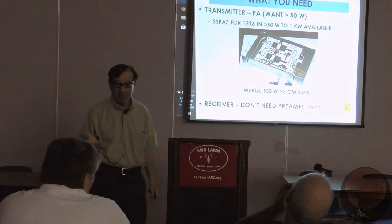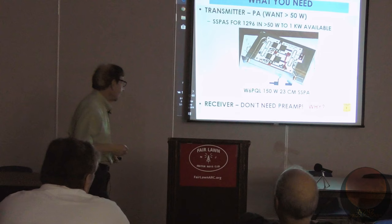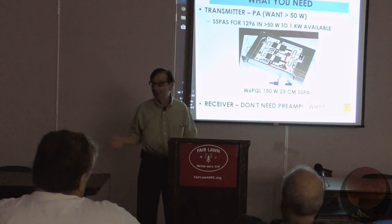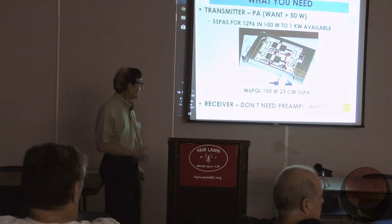Now, as you get into this, you worked him, and you want to work someone else, right? So then you're going to get yourself a better preamp. But to start off, the fellow Bodo who went around with that one Yagi and ran 80 watts, he used no preamp. And his argument was, I don't need a preamp because the stations I'm going to work are all running a lot more than 80 watts, so I'm going to hear them if they're going to hear me. So that takes care of the receiver.